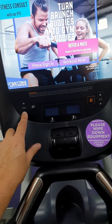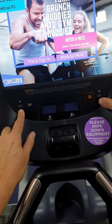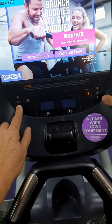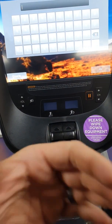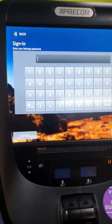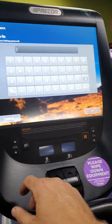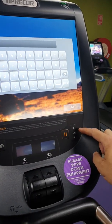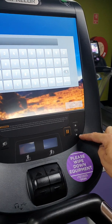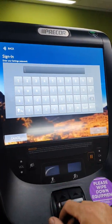So let's do it here: press and hold volume down, keep holding it, then press channel up, channel down, channel down, channel up, and you'll come into this screen. If it doesn't work the first time, just keep trying — hold volume down and press channel up, channel down, channel down, channel up — then let go of everything and you should get this keypad.